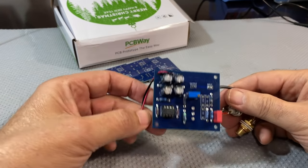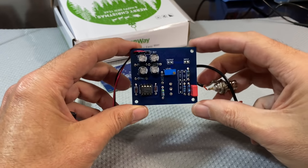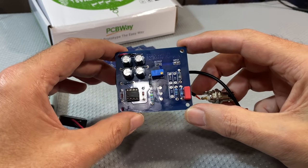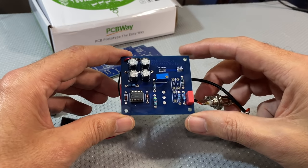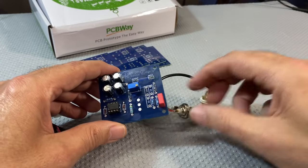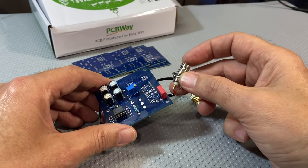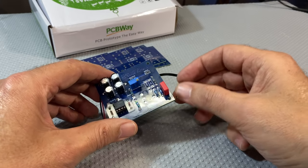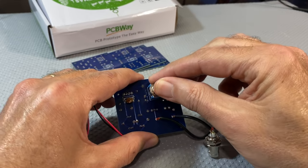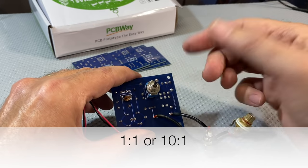And here we have it — it's all done. I decided not to bother you watching me do all the soldering; I'm sure you've seen enough of that. I made no mistakes on this board, which is quite a change, so this version one is going to stay version one. We've got a buffer. Basically what it does is it takes an input signal. You take your signal coming in here — imagine you're probing something like with a scope, except you're doing it with this. Your signal comes in and gets attenuated or not, depending on the position of that switch. One way it's times one or divided by one, and the other one it's times 10, so divided by 10.